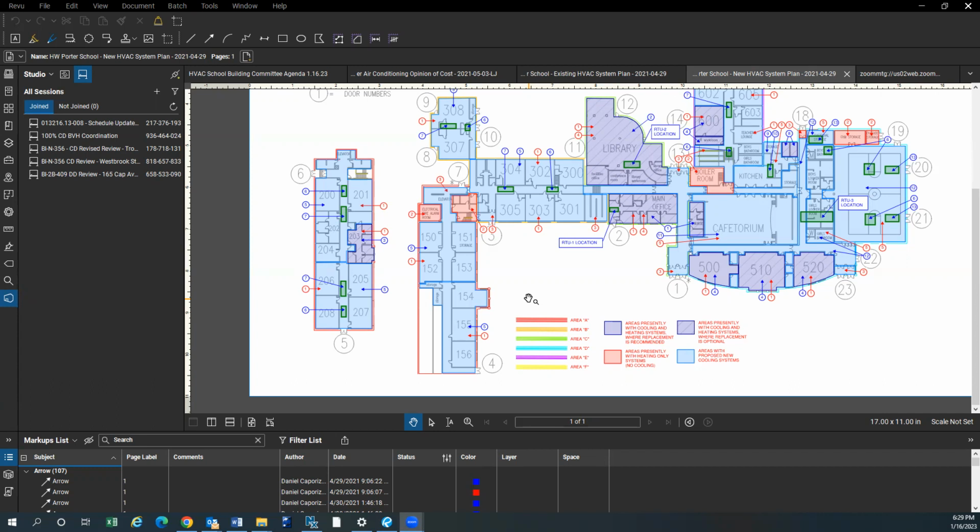Another thing to think about from a scheduling standpoint is that if you phase it right, you can have equipment there when you need it. I've got a project I'm working on right now where we've got 52 weeks to get rooftop units in, so it's a length of time to get equipment. It takes planning and timing on the part of your contractors to get everything on site and ready to go. You want to have it basically sitting there, so when you close up school for the summer, they can move in the next day and start.